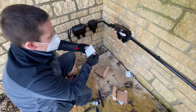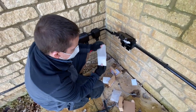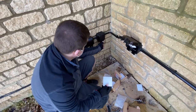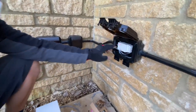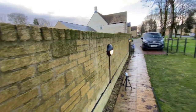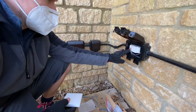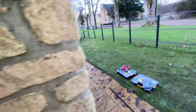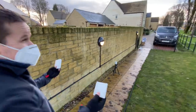Now put this in pairing mode — we want to pair up both of these switches to these lights here. Three seconds, hold it in till the red light comes on — see that red light? And you should be able to click it on and have some lights on. See the lights? Lights off, lights on. That one's paired — we'll pair this one up. Hold the receiver... it flashes, and then lights off, lights on. Lights on, lights off. He's now got 28,000 presses left — I'll use it a few times.